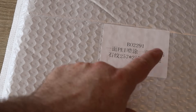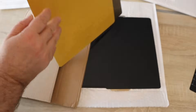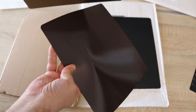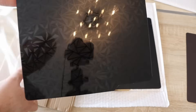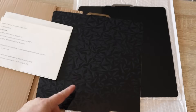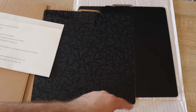The third sheet has PEI on one side and PEO on the other. It even arrived with a magnetic base with a sticker, but I'm not sure why since Bambu Lab printers already have a magnetic base — maybe this is for similar-size printers without a magnetic surface. This side is the textured PEI sheet, which we already discussed. The other side is PEO: it has a diamond pattern, shines brightly, is very durable and temperature resistant, and can be used for PLA, PETG, TPU, or even ABS.